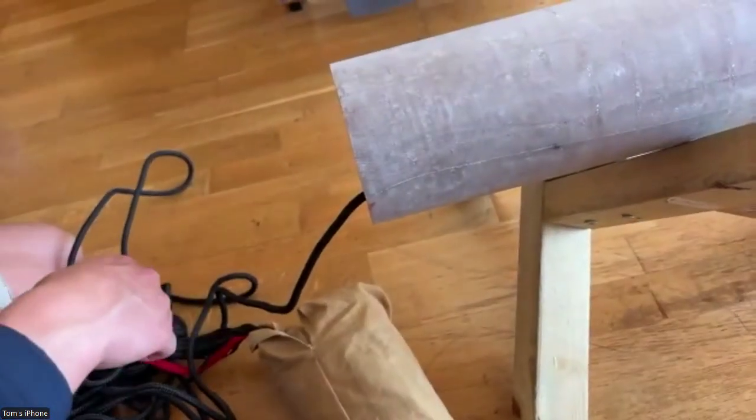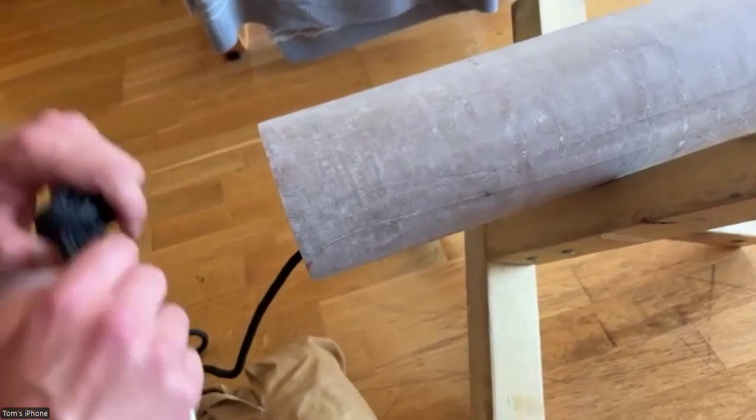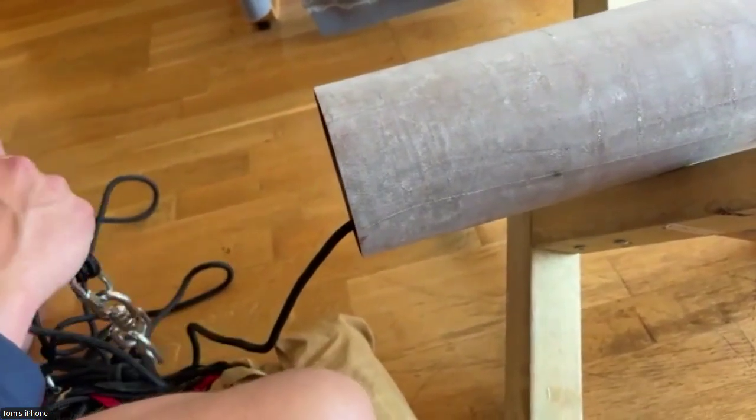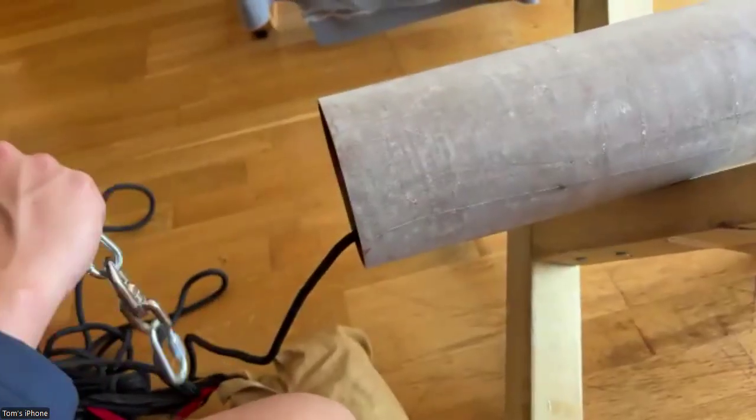One of the things you've got to be careful with is that when you tie a knot into something, that actually increases the weakness of that cord. The kind of knot you've got makes a big deal in exactly how strong that cord is going to be before it comes apart on you. Yeah, that's something we considered; this should be about 80% effective, as in effective load bearing of 80% at the knots. And the cord is rated for 1.8 tons, so metric tons. Yeah, should be plenty.